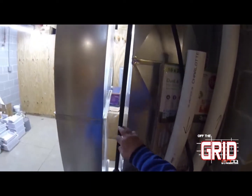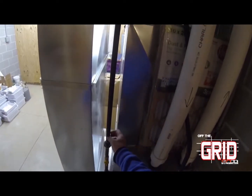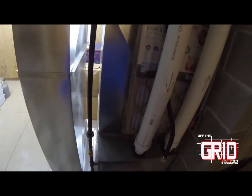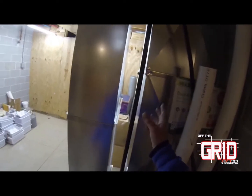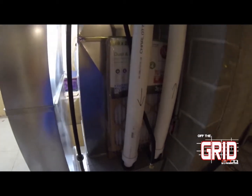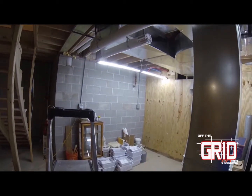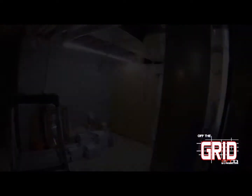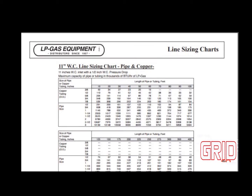So I thought I'd upgrade to steel pipe. With steel pipe, the distance that I'm running, you need to provide 100,000 BTUs of gas to provide 100,000 BTUs of furnace output. You can find sizing charts online. Right now I'm running about 82,000 BTUs, and so even the temperature in the room, given the cold days we've had, is a struggle. Line sizing and length does make a difference. My initial run is about 95 feet, and I can see that I'm running 84,000 to 87,000 BTUs.